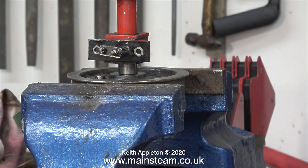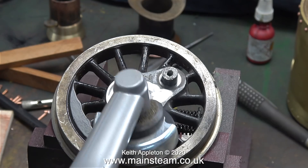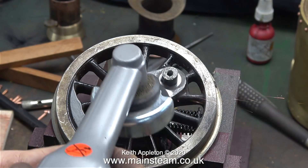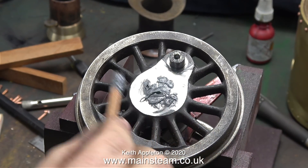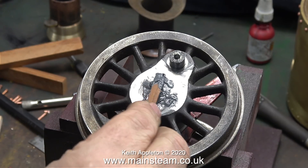I'm using a rivet to mark the position of the centre of the axle because I'm going to re-drill the centres of the wheels using a centre drill, as I showed previously in another video. Once I'd coated both sides of the wheels with the JB Weld I clamped the wheel set in my vise for the JB Weld to cure. This is a centre wheel set and the crank pins were too long for me to keep it level in the painting jig. I'm also cleaning up the front wheel set, using the angle grinder fitted with the flapper wheel disc, and then coating the front of the wheels with JB Weld, making sure that I plugged up the holes where the grub screws are.